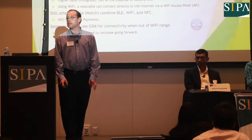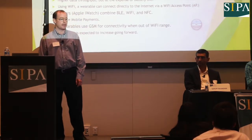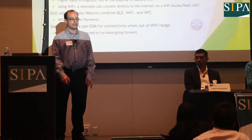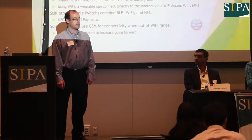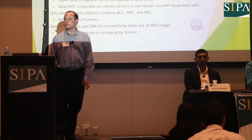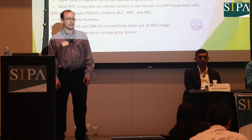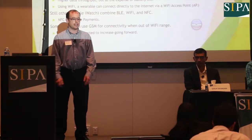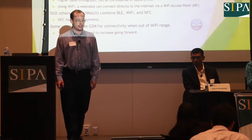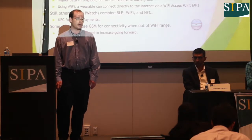So today, most of the wearables that we see are using Bluetooth LE. And overall, this is really a compromise. Like I mentioned, it's low power, but at the expense of throughput. And when you consider some of the use cases, having low throughput can actually lead to an overall increase in system power if the device needs to stay awake longer in order to transfer the data.